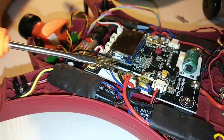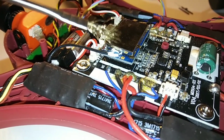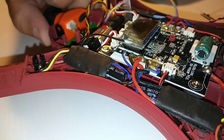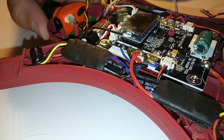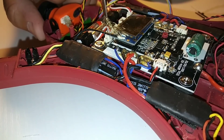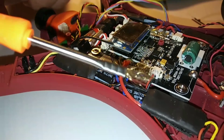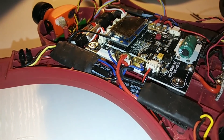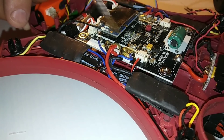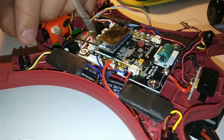I've completely cleaned this up as best I could with the razor, but I don't want to keep digging at it, so we're gonna hit it with this wire brush — just go back and forth until we get the majority of the white stuff off. Even if you scratch up the board a little it's fine, just be gentle. The joints are getting nice and clean quickly. That's pretty much the process.